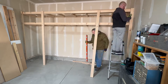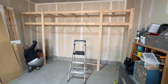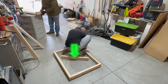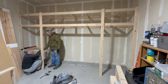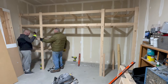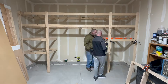Now we're going to install the vertical posts for the right side of the shelves. The next four boxes are going to be quite a bit smaller, but I'm going to start with the bottom shelves first and measure exactly how far I need to go up to fit some larger objects I want to store underneath, like my shop vac. Since these next four boxes are smaller, I'm just going to have one vertical beam in the middle to support the weight. I'll pre-assemble the first two boxes for the left side and then go install them. On the install of the first bottom shelf, we're making sure it fits the shop vac underneath, and the next shelf in between needs to account for the thickness of the MDF on the bottom shelf so everything is even, square, and we can still fit our totes and the shop vac.